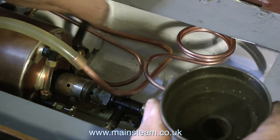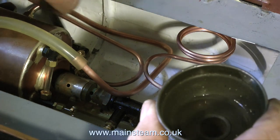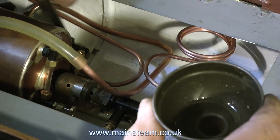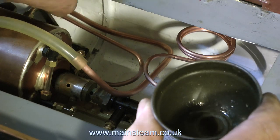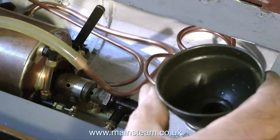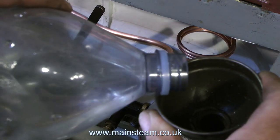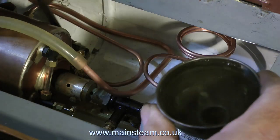Does it work? I put a funnel on the end of some silicone rubber tubing, which in turn fits onto the inlet pipe to the pump, and I move the pump arm — the water's going down, so I think it's working. Yes, the water's going down quite well. Flush with success, and knowing this is the end of the piping extravaganza, I'll do it again: pour some water into the funnel, move the pump arm back and forth, and the funnel's water disappears as it goes into the boiler.